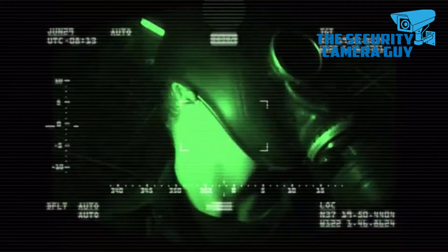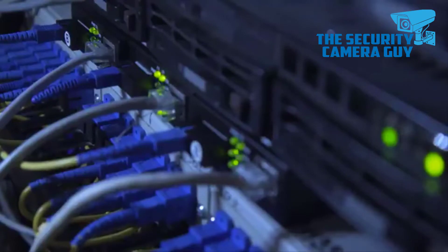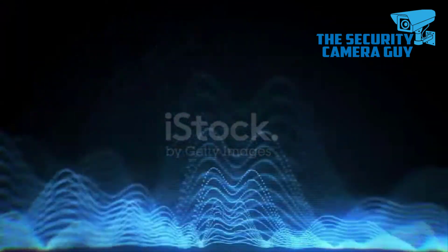The BNC was originally designed for military use and has gained wide acceptance in video and RF applications up to 2 GHz. The BNC uses an outer conductor with slots and a plastic dielectric on each gender connector. This dielectric causes increasing losses at higher frequencies. Above 4 GHz, the slots may radiate signals, so the connector is usable but not necessarily stable up to 11 GHz.